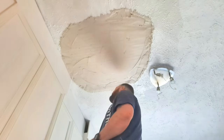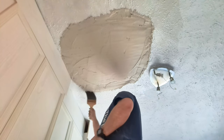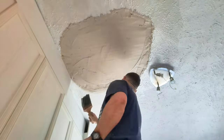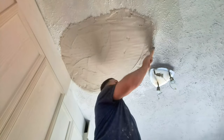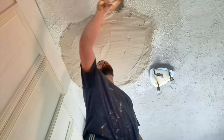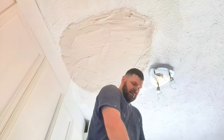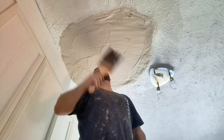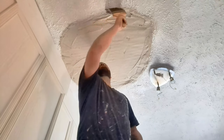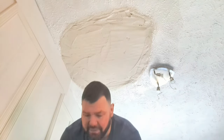Where the plaster has overspilled onto the old ceiling, I'm just going to wash that off a little bit. I know a lot of fellas would have liked to just put a piece of plasterboard right in the middle of this hole, and that would have been fine, that's another way to do it. But the thing is, right on the edge the plasterboard still would have needed filling, because you won't cut a plasterboard perfectly to the shape of that hole, so it'll still need filling around the edges,